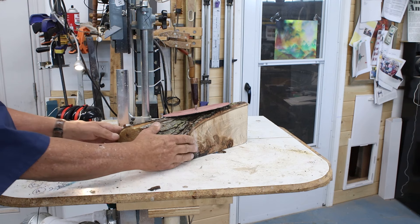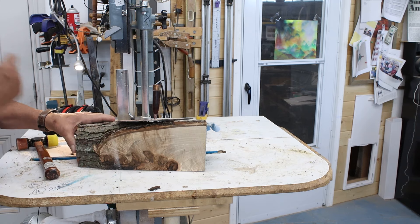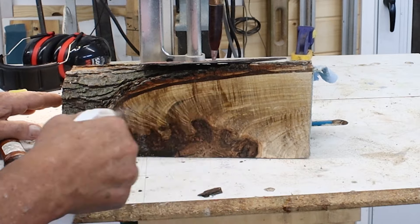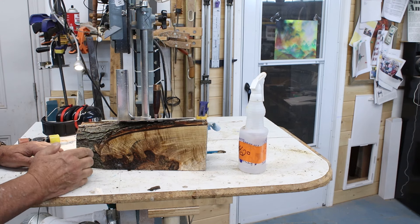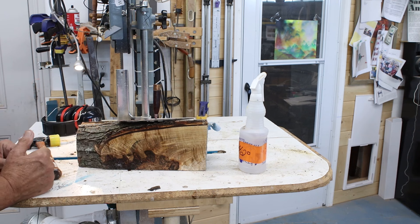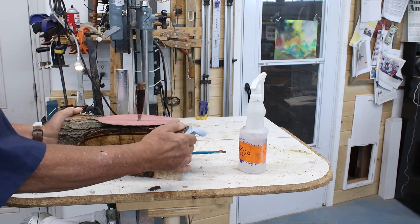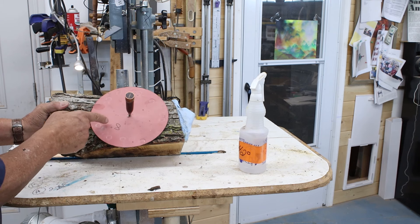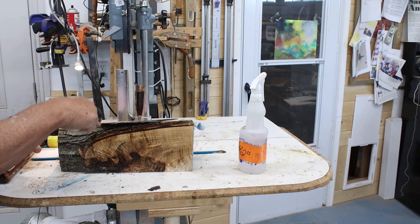One thing about this project — I didn't really enjoy cutting this crotch down the middle, but it gives us an opportunity to see the grain inside. I'm going to take a little bit of water and spray on that — that is really some spectacular grain. If you're ever looking for nice figure in grain, just go to an area that's a crotch in a tree where two branches diverge, like the fork in the road. I've got one of my poster board round blanks here — eight inches — and I'm going to cut this on my bandsaw to this eight-inch template.